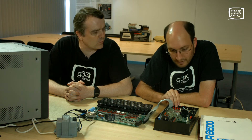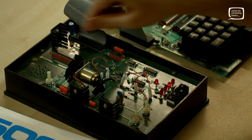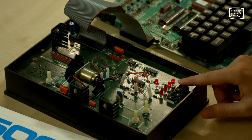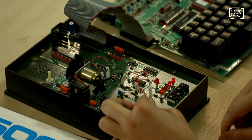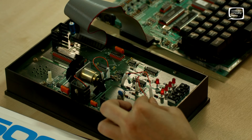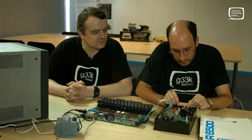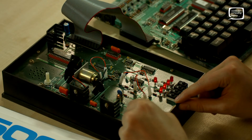It's basically a little computer lab. Flipping the second switch outputs a continuous tone through the speaker - that does sound like the first loading tone of a Spectrum. The third switch: you notice the LEDs have stopped flickering - that's because it's actually reading this potentiometer through the analogue to digital converter. If we turn that up, we can see it counts up through the binary sequence. At the same time, this LED over here is being PWM modulated based on the values - turn it down and it gets brighter, up and dimmer. The last switch controls the brightness of the bulbs.